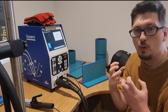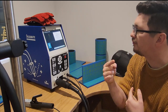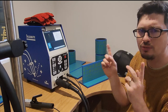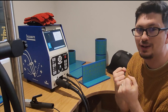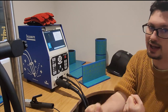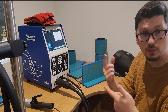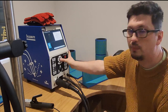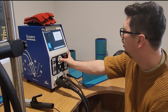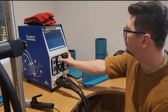And then we've got our argon. Again, why am I being forced to select argon? I don't know if it's something I'm doing with the settings and I'll find out, but it would be nice to have the opportunity to select an active gas, because as I'm training I want to know that the welders know how to select the gas, not just, well, it's argon and away you go. But we'll live with that. So there's all the settings I've picked, and we're going next.